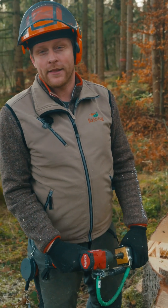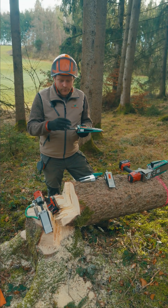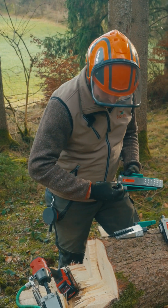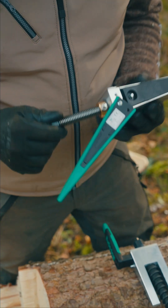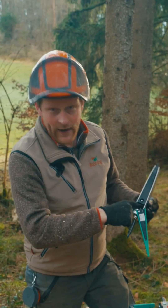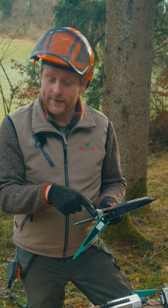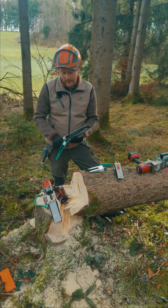Now I'd like to show you something about the maintenance of these wedges. The wedges are all built with spindles of chrome molybdenum steel, and it's very important to grease them daily. Grease nipples are installed in the wedges. These wedges have a semi-integrated spindle — a left-hand thread on one side and a right-hand thread on the other. Half of the spindle is inside the wedge and half is outside, and you grease each area through the corresponding nipple.